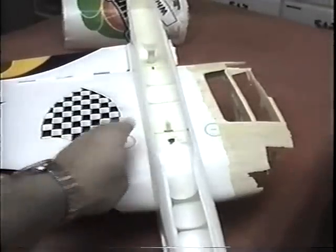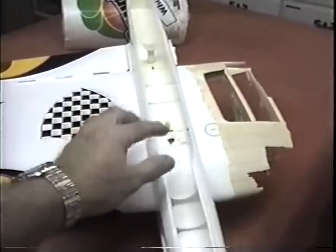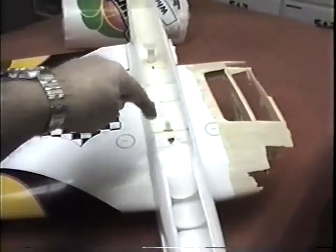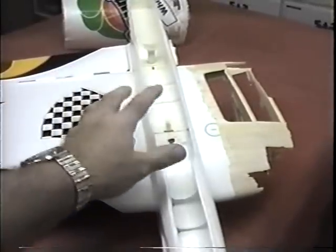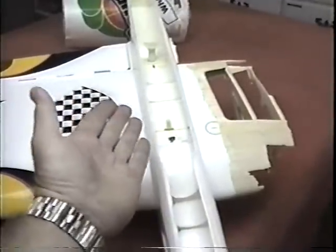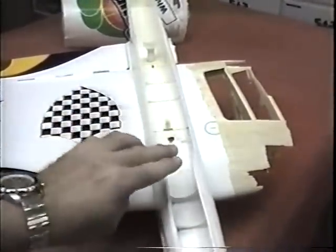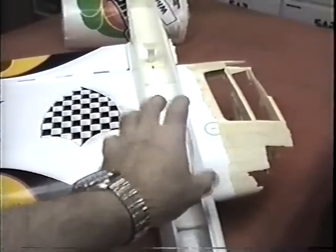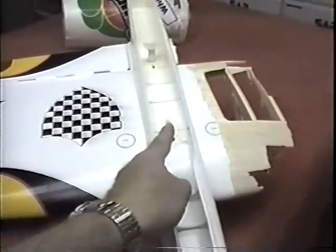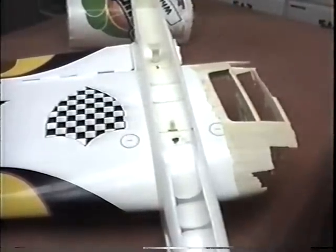Now the strength of this type of wing comes from the high point of the wing. So if we have to cut two hatches, one front and one back, the main thing is you would never want to cut one right down the middle. That would weaken it. We're much better off with two smaller ones if we can get away with them. Then we want to cut the pieces on an angle like a cork, so that when we float them back in with epoxy, we can glass this whole middle of the wing and maybe even add a little bit of strength. But you never, never cut that high point of the wing unless it's, boy, that gets into a high-risk area.